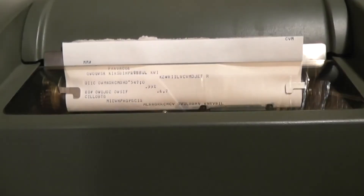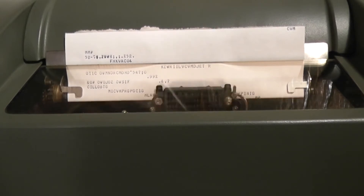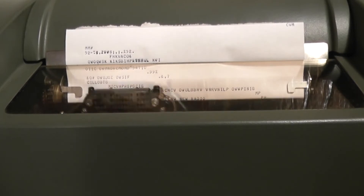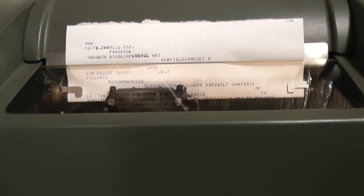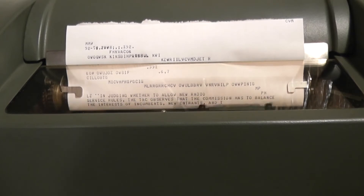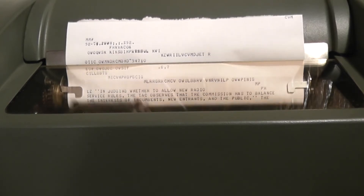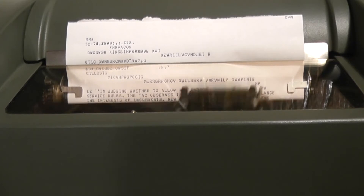There we go. We're getting gibberish, which means I've tuned in on the wrong sideband. I just changed the sideband and here we go — we're getting good copy. So that's how hard it is to tune in the RTTY signal on the vintage equipment; it's really not a big deal. You can hook an oscilloscope to the tuner which would have made it faster. I was tuning in repeatedly on only one of the two tones, which is why we weren't getting copy. But once I raised the audio frequency just a little bit higher, it locked in and started decoding.